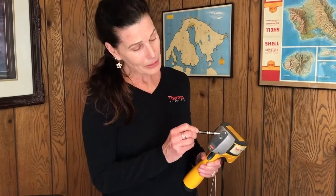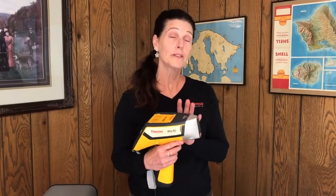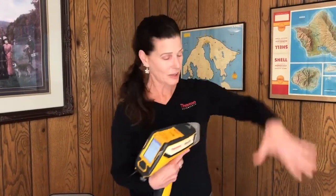This is the measurement window — it's 8 millimeter diameter. This is where the sample will be analyzed, so whatever is in front of this window will determine the results on the screen. The measurement will continue as you have the trigger pulled, and as soon as you release the trigger you'll have a final result on the screen. While you're taking your measurement, there will be a real-time update of results. When you release the trigger, the final result appears and is automatically saved in memory for later recall. The instrument is also hooked up to a computer here — it works completely independently of the computer, but this way we'll be able to see the measurement results on a bigger screen for easier viewing.